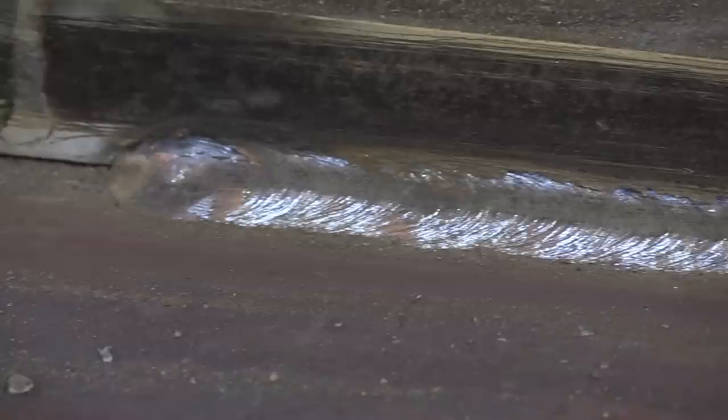All right, that was 200 amps. I'm going to show a restart here — a tie-in right there at that crater. I'm going to try to light up ahead of it and keep my arc strikes where I weld back over them. I'm going to try to make it seem like you can't tell where the restart was. What I can tell right here is 200 amps is maybe not quite enough — the way that flux is just swirling around in the puddle, it's a little bit cold. It's within the range of the rod, but for thick metal like this on a fillet weld, I'm going to bump it up a little bit.